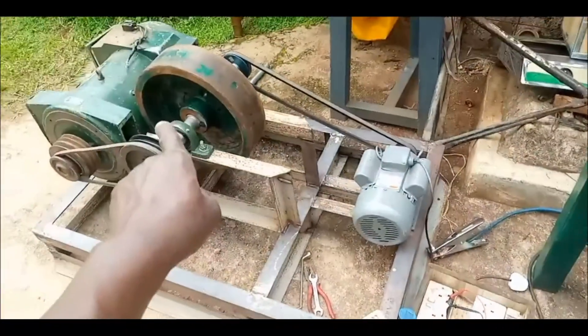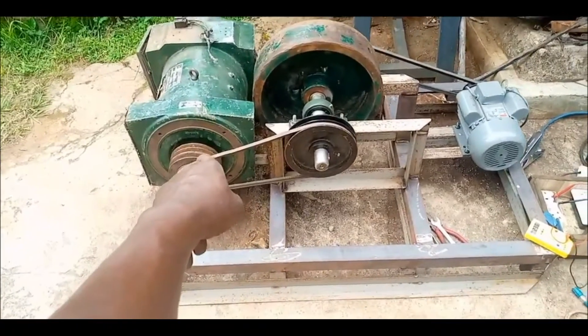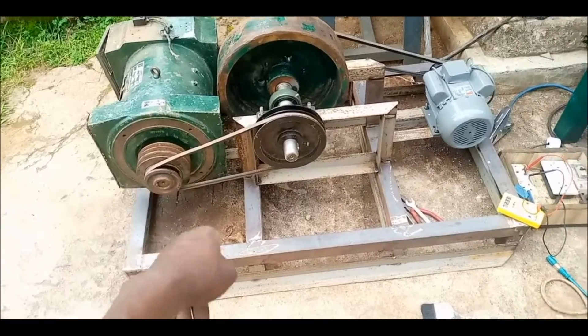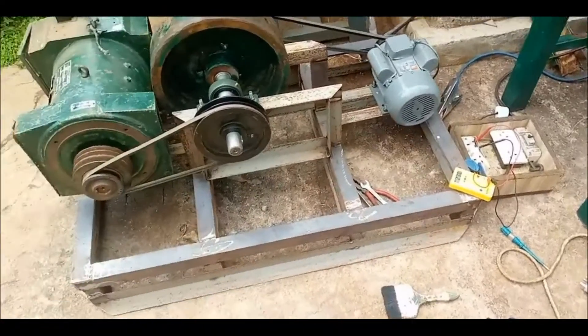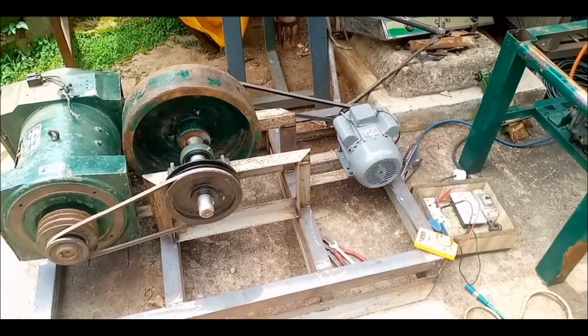But remember our machine here — it is giving us 310, 310. So, our machine is giving 310. That means the heat is too much. We need to step it down. If we don't step it down, that means it burns everything. Too much heat. Excessive voltages.